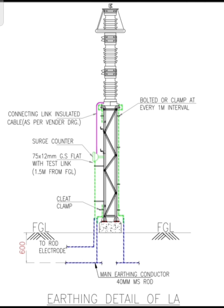That dedicated earth must further be connected to the existing earth mat. This means the practice of connecting your lightning arrestor or surge arrestor with a dedicated earth in an isolated way is totally wrong. We have to give one dedicated earth electrode for each lightning or surge arrestor, but at the same time that must be connected to the existing earth mat.